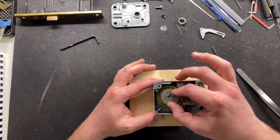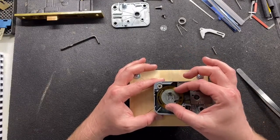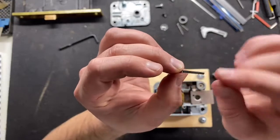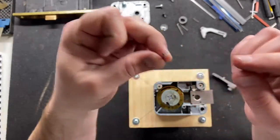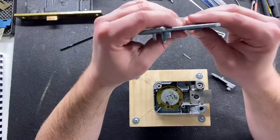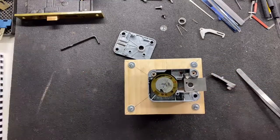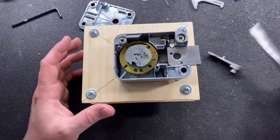Also, the spline key that came with it, I know from having looked at pictures and diagrams now, is not original. It was manufactured probably out of some wiper insert, and it is not quite thick enough and not bent in the right direction. You can see, there we go. Normally the bend in it would be going inward toward the spindle instead of crosswise like that. Because in that direction it goes straight into this nylon washer that's here in the back plate.